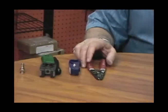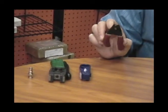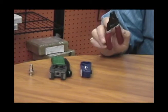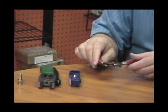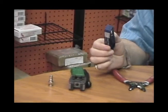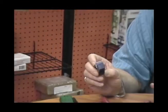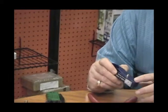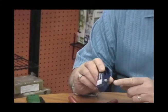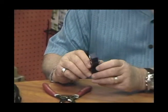To start off with, you want some basic tools before you start. The first thing I'd like to recommend is a multi-cable connector cutter. This is part number 63020, made by Klein. It's a great tool for cutting round cable. Next thing you need is a good stripper. This happens to be the ICM strip tool, part number PSA 59-6. This particular strip tool has ball bearings, comes with an extra set of blades, has a ferrule for cleaning up RG-6, and does both RG-59 and RG-6 cable.